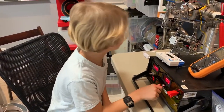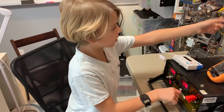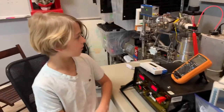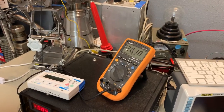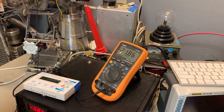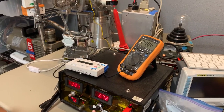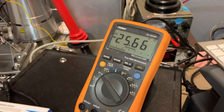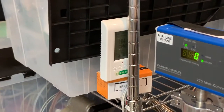The power is just at 16 and this thing's not really doing anything. We're going to check over here and over there as well. Now we're going to shoot for 25,000 volts, so let's start making our way up. The Geiger counter is still at background. You can hear it going up. All right, this is 25,000 — let's just sit for a minute. Yeah, it's already much higher — you can hear it. It's not 180 yet, but climbing.